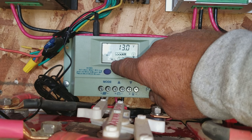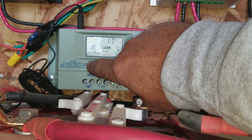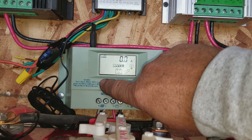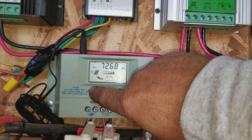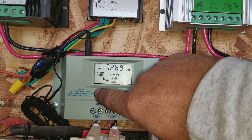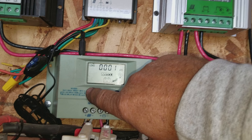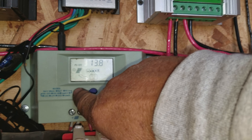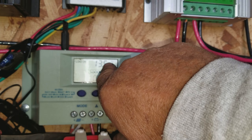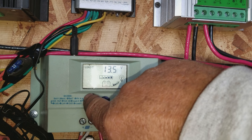As you can see, now it's showing that a charge is coming in, and I've still got that shut off. 17 degrees Celsius, 2.7 amps coming in on the photovoltaic. The load is not showing anything because there's nothing connected to it. 7,268 amp hours. Load says used one amp hour. The photovoltaic is off at 13.8, so I think I've got to change that setting. Load on at 13.5.